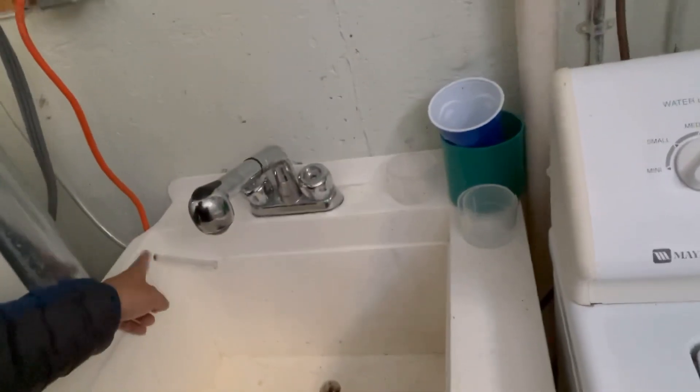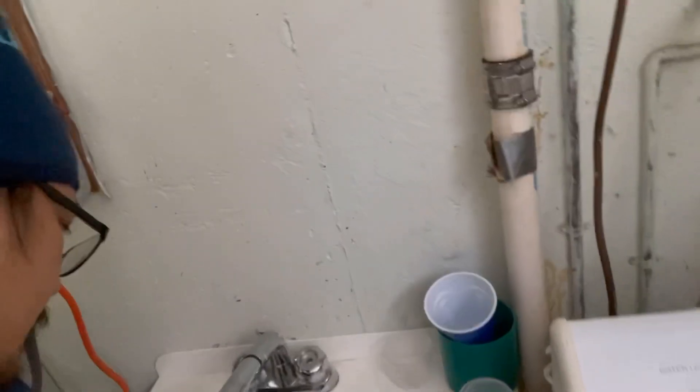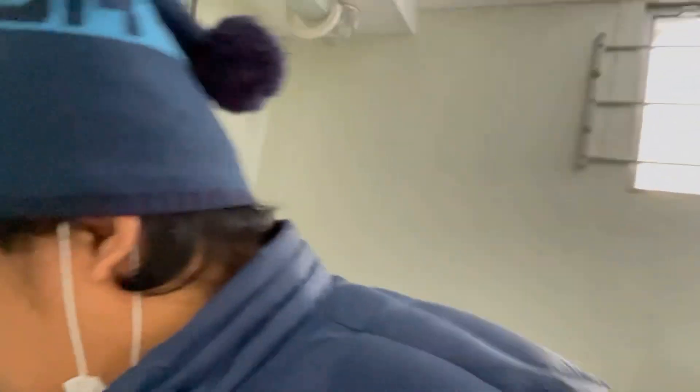See this? It's stable — it's not going anywhere. In winter, the drain goes in here to the sink because we don't want it draining outside where it can freeze. You need to follow the latest code, because the code reflects solutions that have been found to work and helps everyone. The code requires the condensate to drain to a proper indoor drain.